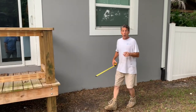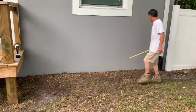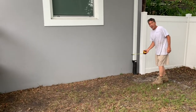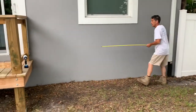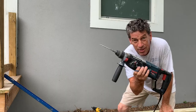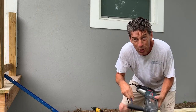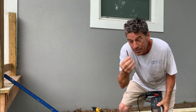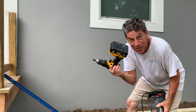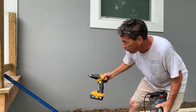The first thing that we're going to do is measure from the framing to the gutter — that's how far the 16 feet is going to be. I'm going to use a Bosch hammer drill to drill holes through the board and the concrete, and then I'm going to use tap cons with a cordless DeWalt to attach it, making sure I use a level to level the board.